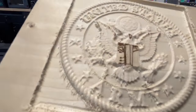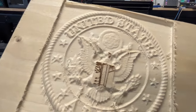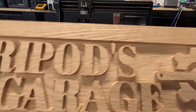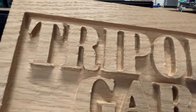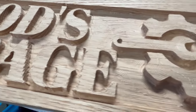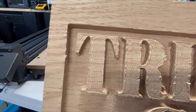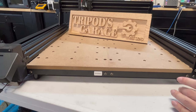Next, I was a little more ambitious and did a relief. It's not actually deep enough to do a really good relief, because it still left some of my laser engraving behind, but you get the idea. Since I had a piece of oak laying around, I decided to give this a try: Tripod's garage sign, established 2019. Since I'm new and don't know the limitations of the machine, I went with the recommended settings in Easel for this end mill, and it took about ten hours. I can't control the speed of the spindle, but it came out not too bad.